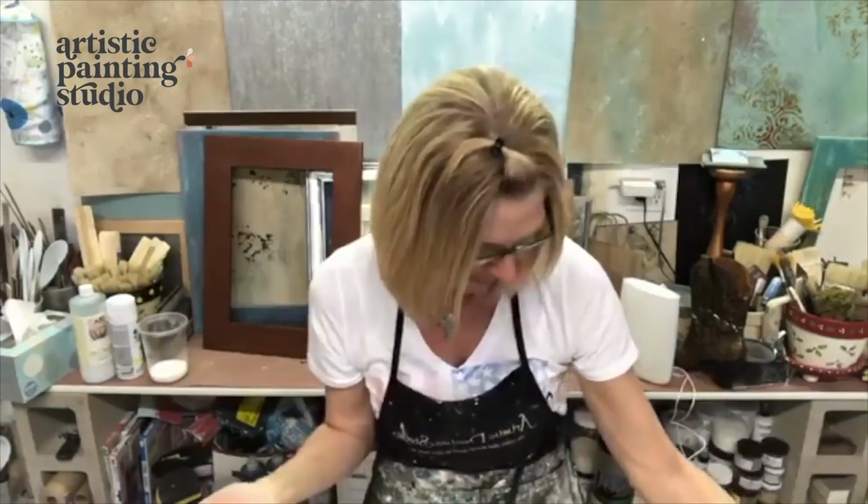And it has got to be one of the easiest finishes, okay? This is truly a 2-step. I didn't paint underneath it. I went directly onto the wood. I did my strié with the texture medium and the corduroy tool, let that dry, sanded it, glazed it. I'm done.